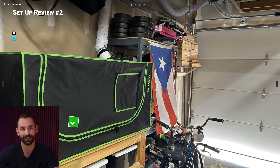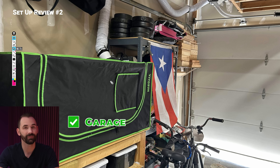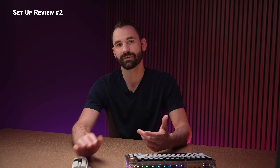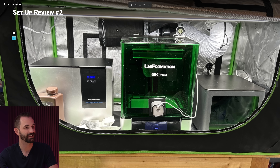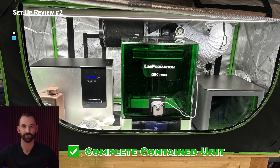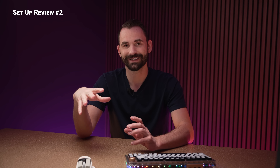Here we have another user. This one is in a garage - we can tell because there's a garage door over there. They've got a really big grow tent, kind of what I was talking about before in the last one. It looks like there's a heater vent or exhaust vent that goes all the way outside. Even in the garage, which is generally pretty open to air, that's going to definitely do a lot more to make it even better. Inside the grow tent, there's a little camera mounted on front, and he's got the tube printer, cure station, and wash station all inside the grow tent. It's a completely contained unit out in the garage with a vent - very, very safe. Even that grow tent is going to keep away dust, which in a garage can get inside the resin and make things worse.